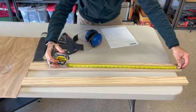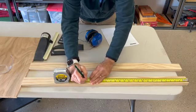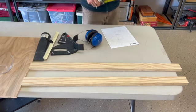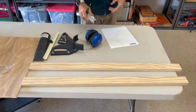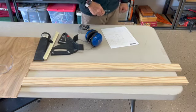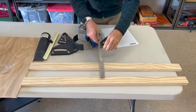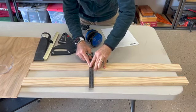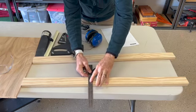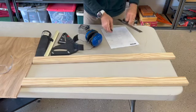So this is 22 and we'll put 22 in here also. We're going to get these to the miter saw. I'm actually going to go ahead and also draw a line across here just so I can make sure I hit it correctly, so I'm going to grab the square real quick. This gives you a better idea of exactly where your saw is going to cut, so it's a good thing. We'll get that marked and then up to the saw.